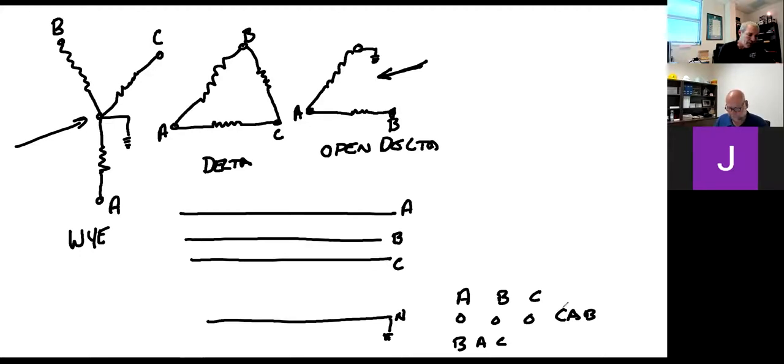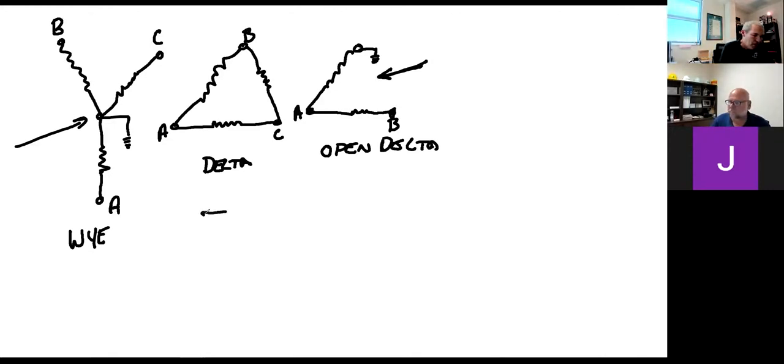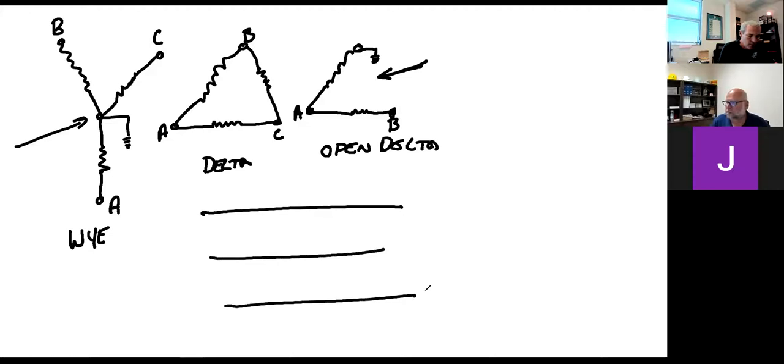All right. If I've got, let me clean that up. So if I have two phases of primary and then one neutral, it might be an A, a B, or it might be a C and an A. So you guys get the gist right here. It might be a B and an A. It's going to be a mixture of different phases all along. And if you have one phase, this might be A, B, or C. All right, that's how the utility industry designates phases by letter. They also do this by color. We're going to get to that as soon as I clean this up.